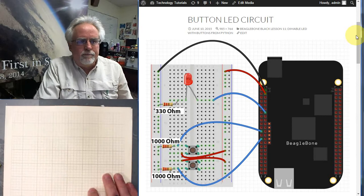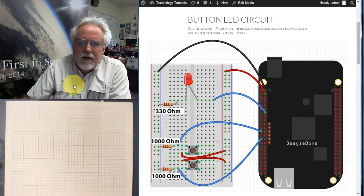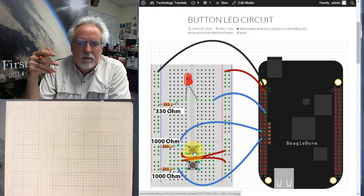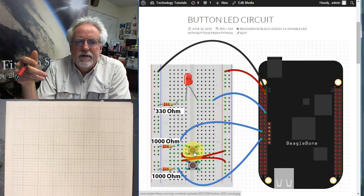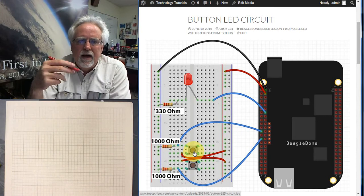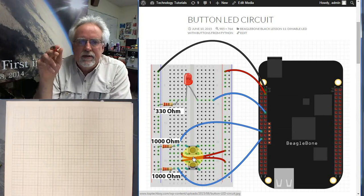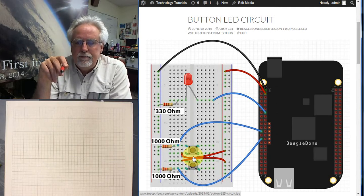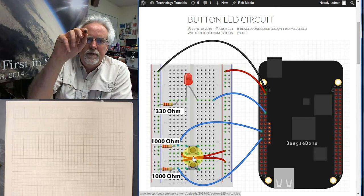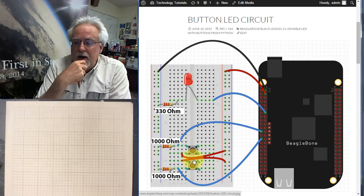Okay, we're going to have a variable called BP for button push, and it's going to start off at 0, saying that the button has not been pushed. If we push the top button, we want to make things go brighter. So if I push the top button, that is going to be a BP of 1. If I push it again, 2, again, 3. So I count the number of times that button is pushed, and every time I push it, I increase the BP variable by 1. If I come down here and press this one, I decrease the BP variable by 1. And so BP is going to keep track of the net number of pushes. If I go up, up, up, down, up, up, down, down, down, down, up is going to add 1 to BP, down is going to subtract 1 from BP.